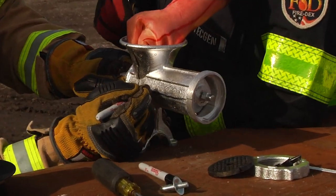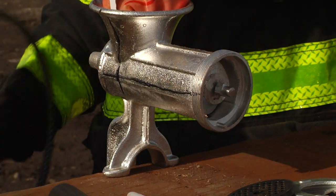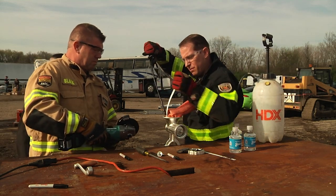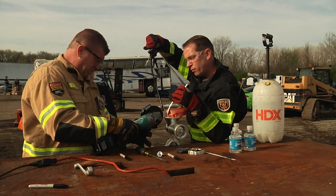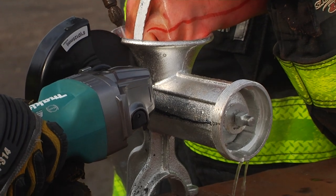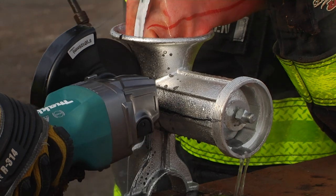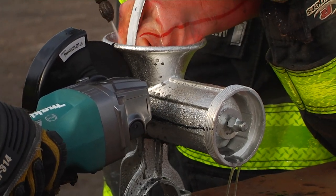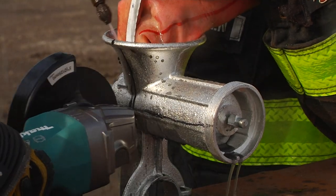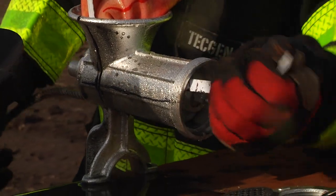You'll see they're making our lines. What we like to tell everybody is — if you look at it from the front at the top — about half. The top is more of an oval shape, so you want to be at half of that. When you're doing a horizontal cut, just visualize half of the diameter of the cylinder that is the discharge. You can see they're spraying the water — we don't want to spray it right on the electrical machine, just where the blade makes contact. The vertical cut is more challenging because of the way the machine is beveled; you'll cut at the top and then work your way into the machine. Now they're front-loading their shim for the horizontal cut.